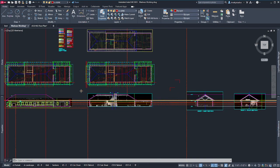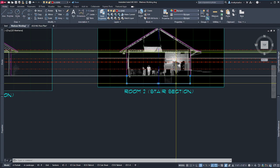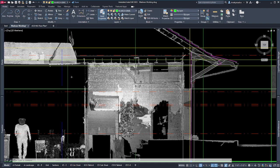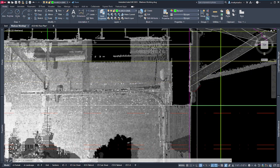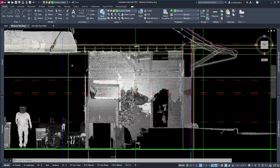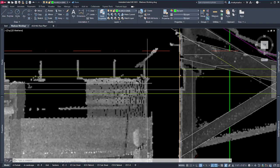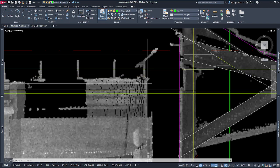And then I just swapped it to the right layer. Because I'm on an architectural drawing, oh, this is a section, actually is a structural drawing, but nonetheless, I put on the arch dims, we can correct that sort of stuff later, that's not a big deal. Then, now that I have the line in, I had to extend all these down to hit the right spots, and when I offset this with the new wall location, I offset it out 5.5, which made a lot of sense. Gosh, look at that distance. That scan is never that inaccurate. We're talking 1.25 inches.